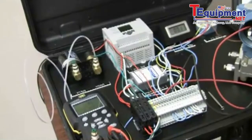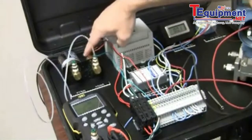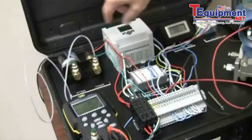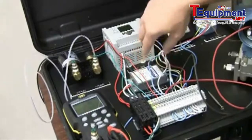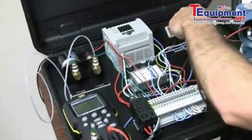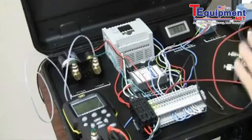So what I have here is a pressure transducer, 100 psi, a pressure switch, 100 psi, I have a PLC here, Allen Bradley. I have AC coming in and a 24 volt DC supply here. Fuse block system here with terminal blocks. So the loop is powering up my additional loop indicator, my transmitter, that's a temperature transmitter, my pressure transmitter.